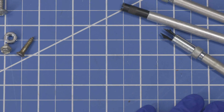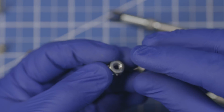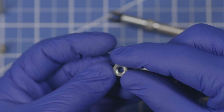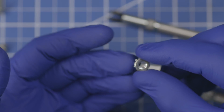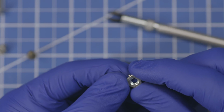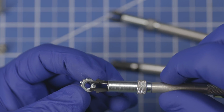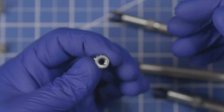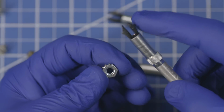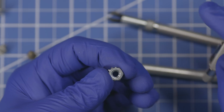Now, there are other designs that I don't have here. There are nut starters that are like a little three-prong thing that bites onto the three of the faces. There's a couple reasons I don't prefer that kind. One is it generally only works for very, very small nuts. And two, you're just adding bulk. The center reach works just fine. If you're talking about really, really small nuts, like number 0 nuts, then this won't fit in there. This is kind of number 4 up to maybe a 1/4 inch, something like that. The external grabbing kind are kind of all you're left with.